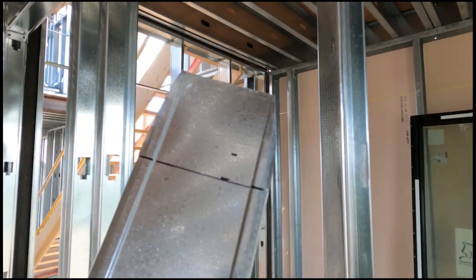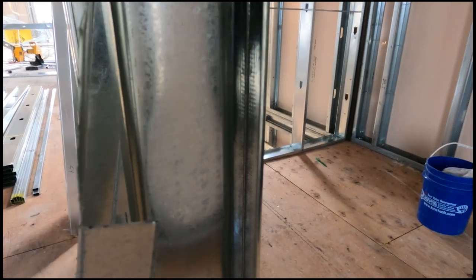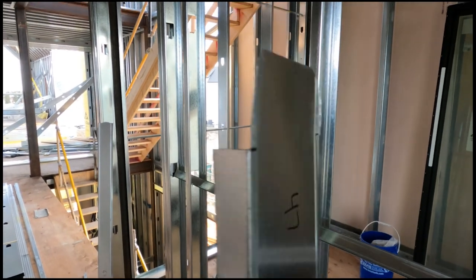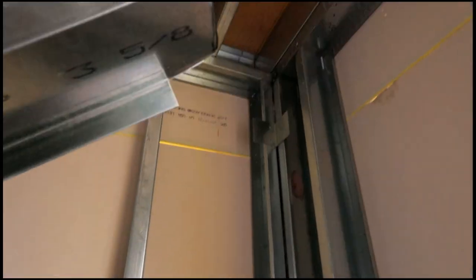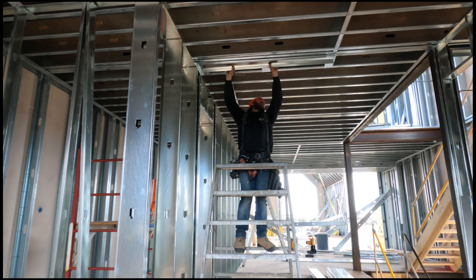There's the flap. What I do is cut it about a quarter inch back from the ledge it's going to be sitting on, then give an extra three-quarters of an inch for the drywall to pass through — because you want the drywall to pass through both top and bottom. For example, if you're going to flap that over a six-inch steel stud, cut the flap five-and-three-quarters plus another three-quarters, so six-and-a-half back, to allow for the drywall to slip through and give you a bit of a ledge.